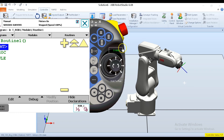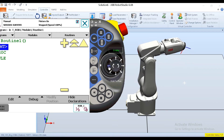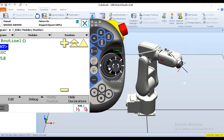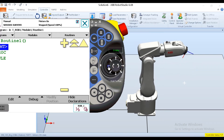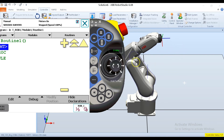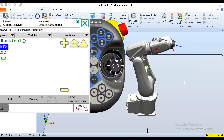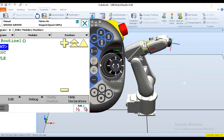With my dead man pressed and motors on, I'm in axis one through three. I just use my joystick. Pressing left and right on the joystick moves axis one counterclockwise and clockwise. Next, pressing up on the joystick moves axis two — it moves the arm back, which is counterclockwise from the center of axis two. Notice that as I rotate that axis, everything else just follows along — it doesn't move independently. That's the advantage of the other jog modes.